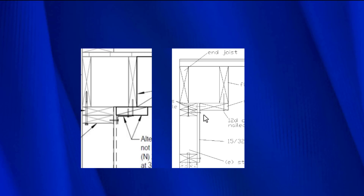This one is actually a whole lot simpler — it's just nails. You put some nails here, some nails here, some nails here, and some nails here. With nail guns, everything goes so fast. Compared to this system right here, it's really a lot more difficult. The way the FEMA method should have been done is they should have put the plywood up, nailed the plywood to the upper top plate, nailed this block to the joist, and then made this metal connection. When they made the metal connection, this one can be an inch and a half — that's what the L90 is designed for — but this one should have been two inches, because we need a half inch through the plywood and then one inch into the framing. So this detail has some problems. Whether or not P1100 is going to deal with that, I have no idea, but this system is a whole lot simpler.